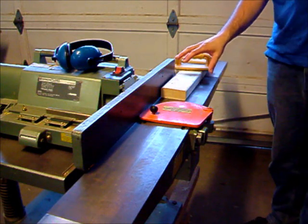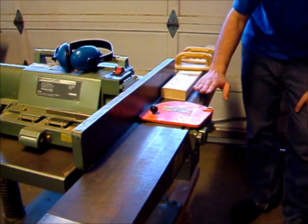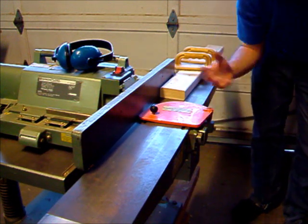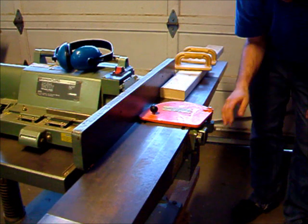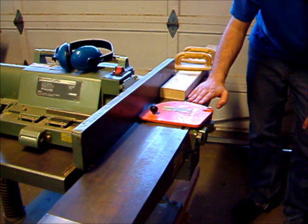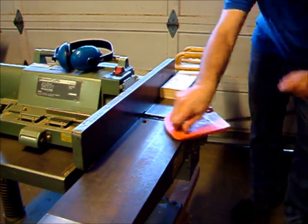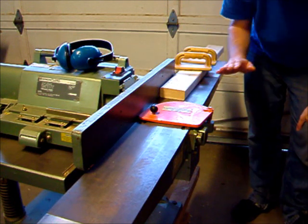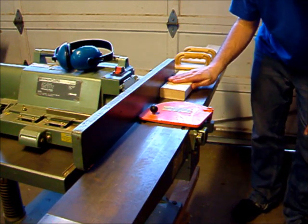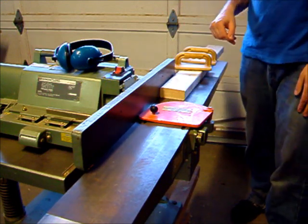When you're getting ready to run a board through the jointer, the one adjustment you're going to need to make is deciding how much of the bottom surface you're going to take off. Underneath the table there's an adjustment screw that lets you raise the infeed table anywhere from a 32nd of an inch down to an 1/8 of an inch cut on this blade. I much prefer to just take lots of small cuts, because I'm just trying to get a good surface to work off of, so I have the infeed table set for just 1/32nd of an inch.